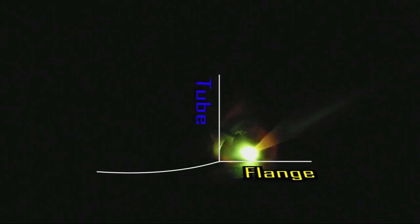If we bring up the cross section here, we see the tube on top and the flange at the bottom. Look where the focus of the actual arc is. If I bisect this area, you can see it actually lands just below where the joint is located. We're focusing our heat on the flange side more than on the tube side, because the flange can take the heat whereas the tube cannot. Once the puddle builds and blends its way in, everything will make it through just fine. Focus more on the flange and let the puddle build.